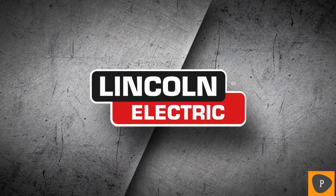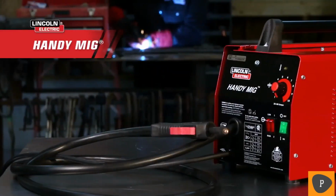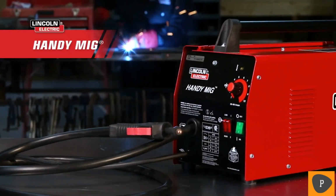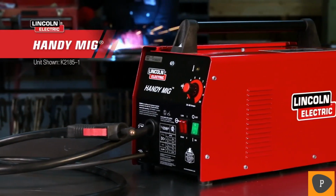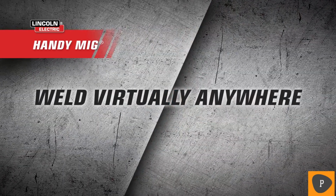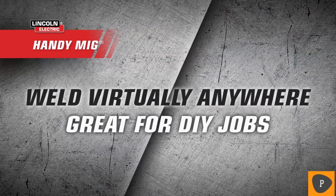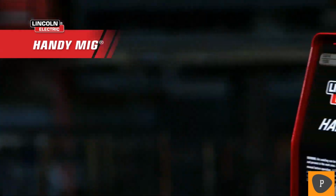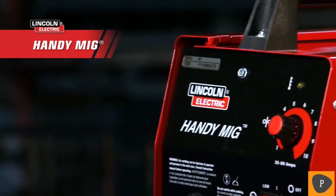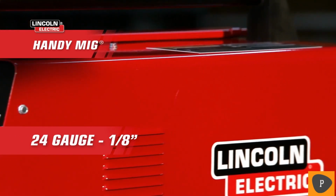With Lincoln Electric, get the right tool for the job every time. The handy MIG Welder's portable design and compatibility with household outlets give you the flexibility to weld virtually anywhere, making it exceptionally useful for around-the-house DIY jobs. With four output ranges, it has the versatility for home repair and hobby projects on mild gauge steel found around the house, from 24 gauge to 1/8 of an inch thick.